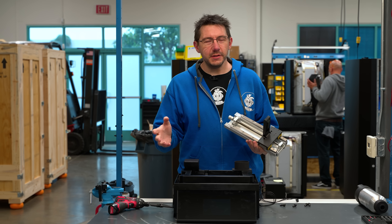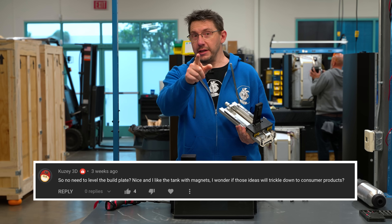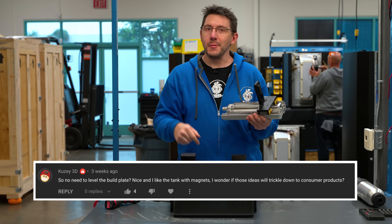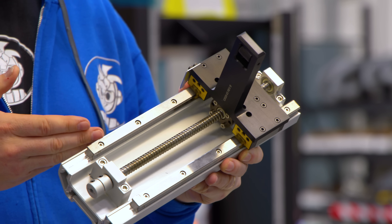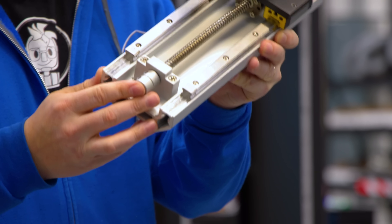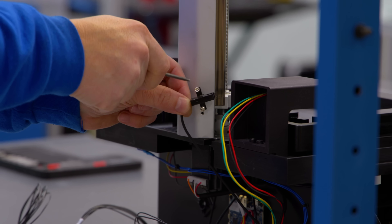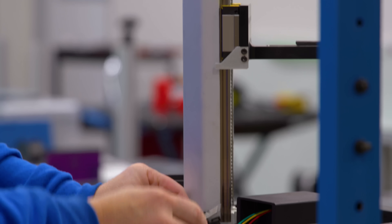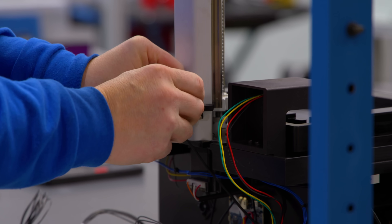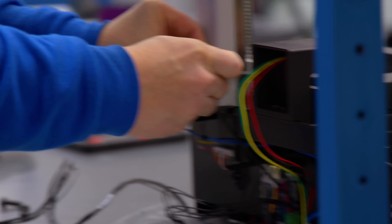The next comment is from Koozie3D, talking about being able to level the build plate. This is the Z-axis — that's a big ball screw right there, with linear rails on either side. We're going to attach it to the machine. Here's the leveling sensor, and this is what interrupts it. It's got two screws to put in, and before we attach the Z-axis, these screws have to be tightened down.